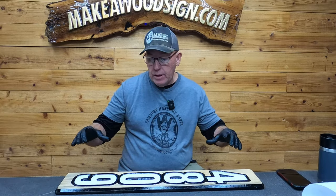Now I'm going to let it set for about an hour. When we come back, we're going to put some reflective glass bead on here. The reason I'm letting it set is because if I put it on now — especially since I put the paint on so thick — the glass bead would sink all the way into the paint, and then that glass won't be protruding beyond the surface of the paint, which defeats the whole purpose. We're going to let this set exactly 60 minutes, then come back and sprinkle some glass bead on there. So stick with us.